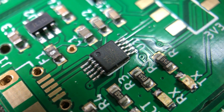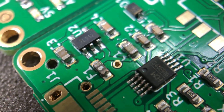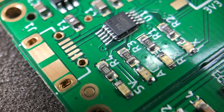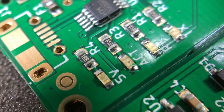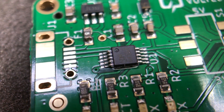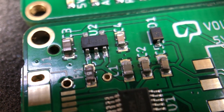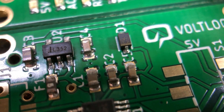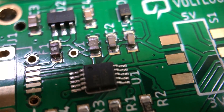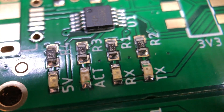Here are some close-up images of the soldering quality — it looks perfect. This is lead-free so you won't see a lot of shine in those solder joints, but that's normal for the lead-free process. Every single joint looks fine and there is no discoloration of the PCB whatsoever. Professional-level assembly. What I love is that for the parts that don't get assembled, they don't apply solder paste on those pads, so you have fresh pads to work with when you assemble the rest yourself later — thumbs up for that attention to detail.